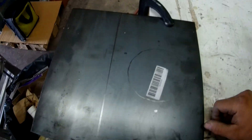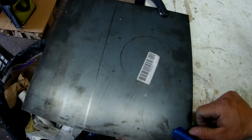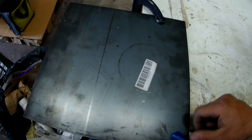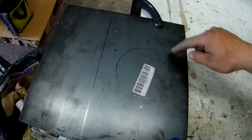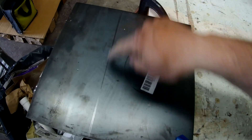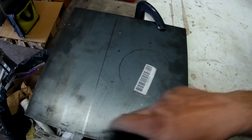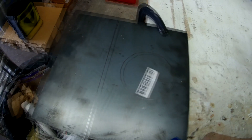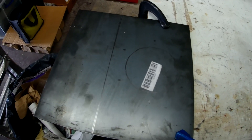This is how I'm going to start my template off. I picked up this 12 inch by 12 inch piece and this is where the motor mount is going to connect, so I need to cut out this hole and trim this line out. Then I'm going to weld four posts on it. Basically, I'm fabricating a motor mount here.